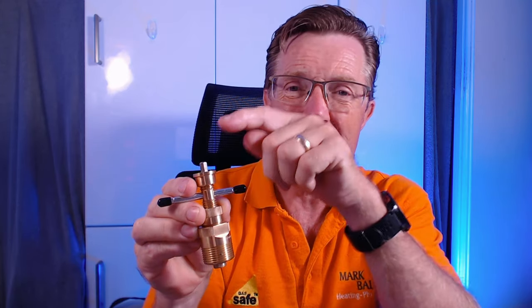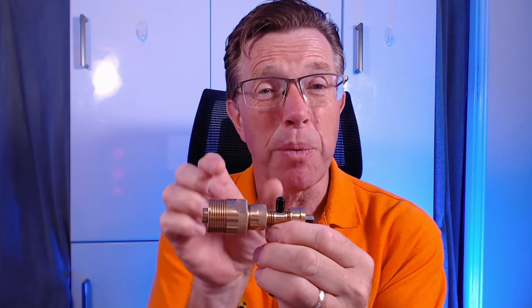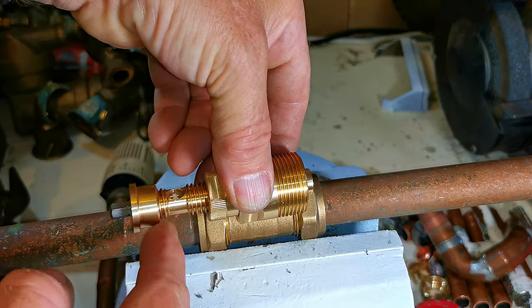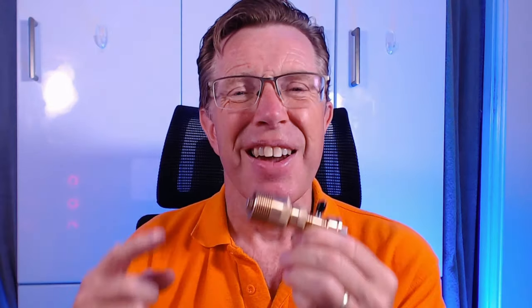To sum up: this is a great little tool — I recommend both DIYers and professionals have one in their toolbox. It takes off 22mm and 15mm olives, and the hardened steel adapter on top lets you use various tools to remove them quickly. The only downside is that in some circumstances it's a little bit big — for example, taking out a gate valve where pipes are fixed, it can be too long. In those cases, the 15mm olive cutting tool is quicker. Let me know in the comments if you've got any better ways of getting old olives off. Thanks for watching!